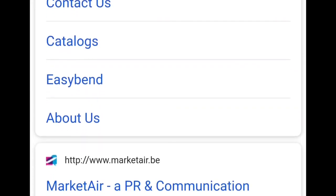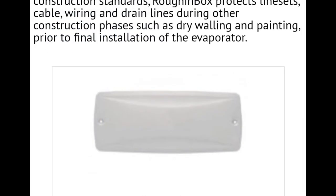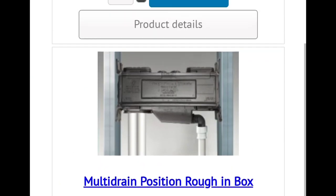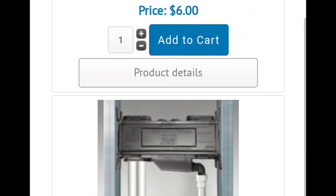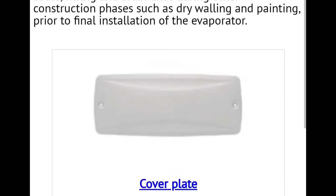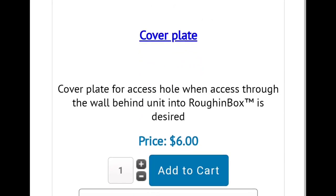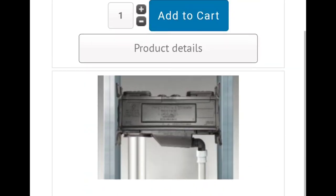I want you to know where to get information on the rough in box. Type in Market Air on Google and click where it says rough in box. Once you click rough in box, you're going to be able to see the rough in box I used in this new construction home and the price. It says multi-drain position rough in box — $53 — and the cover plate is $6. It says designed specifically to conform with North American construction standards. The rough in box protects line sets, cable, wiring, and drain lines during other construction phases such as drywalling and painting prior to final installation of the evaporator. Links in the description.